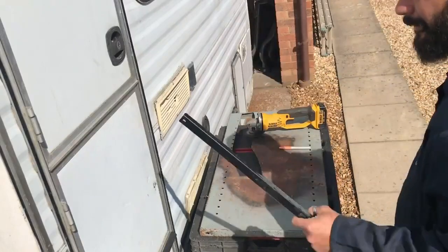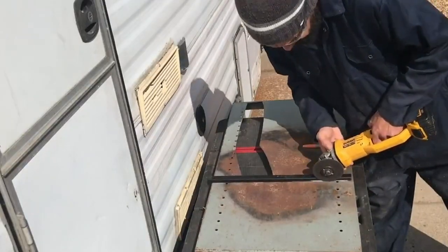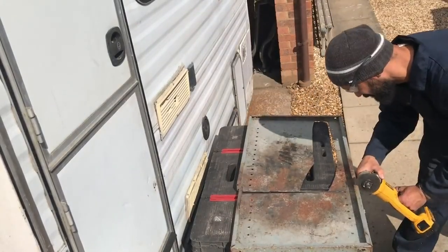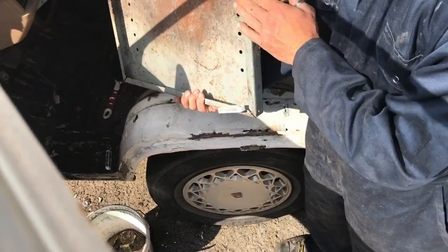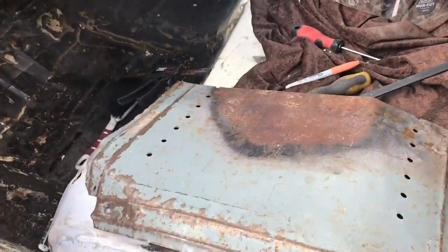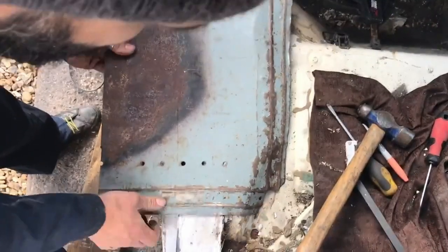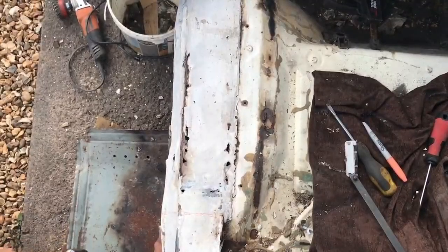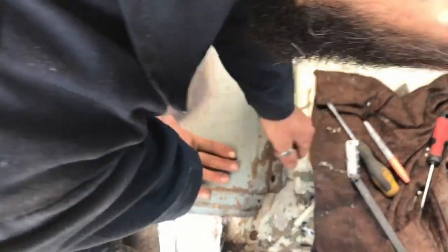That's my new favorite toy — I use this as a straight edge. It's magnetic. So that's how it starts. At least now I know it's gonna be wide enough, especially when I fold the edges back. So we've got the metal beaten up a little bit — started to hammer it into shape. We know along there it has to be a little bit more round. And that's it really — just step by step, a little bit of hammering here and there.